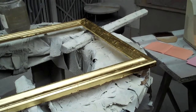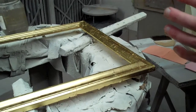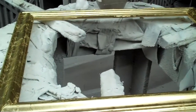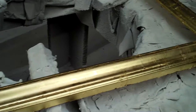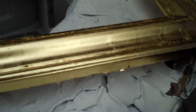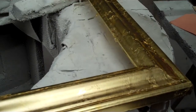We've laid the gold all over the whole frame and left it to dry for an hour or two until everything has dried out completely. Remember these little grooves — the gilding water will gather in there a bit, so it'll take longer to dry in there than elsewhere.